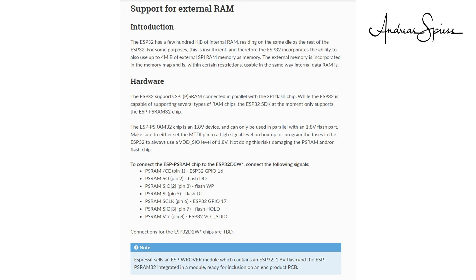A word on PSRAM or SPIRAM: this is an external random access memory chip of up to 4 MB. So far, this memory cannot be used by the standard Arduino IDE and is probably not needed for regular projects. If you use MicroPython, this RAM seems to be very valuable. Python, unlike C++ used in the Arduino IDE, does not use a compiler on your PC. Instead, the source code and byte code is stored on the ESP board itself, and because you can change code during development it is not stored in flash memory but in RAM — this is why you need more of it. With the right version of MicroPython, you can use PSRAM. We will look at these things when we cover MicroPython.